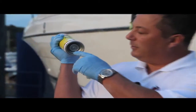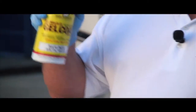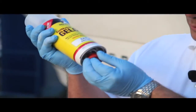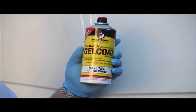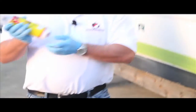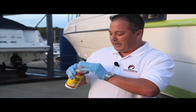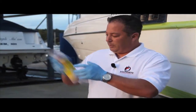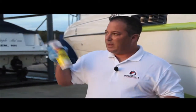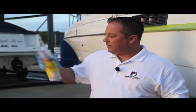As you can see in the back, this is where the MEKP sits. How we activate it is by popping off the red cap, putting it underneath, and pressing down on it — just like that. The red cap has a pin inside that releases the MEKP. What you want to do is shake it up and get the MEKP circulated through the gel coat for an even cure.